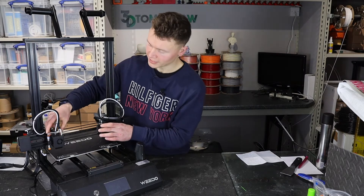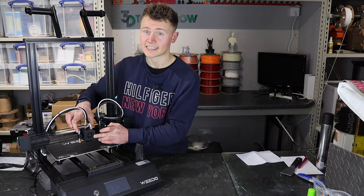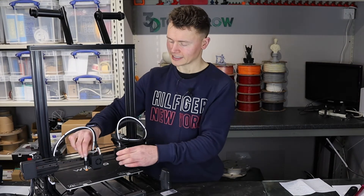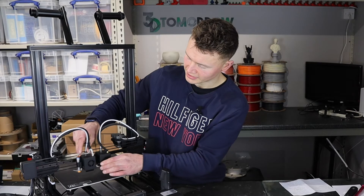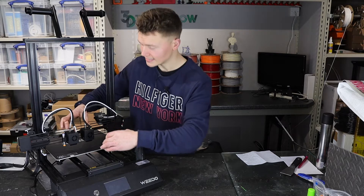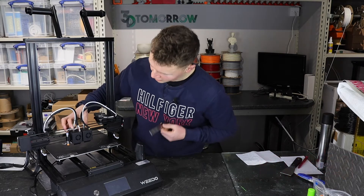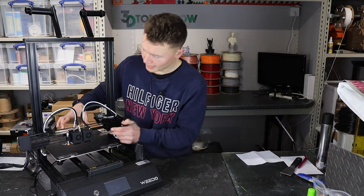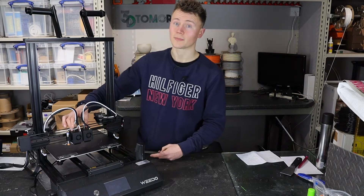That's all quite nice. On this side it's a little bit less X-efficient because we are incorporating the Z sensor as a magnetic probe sensor, which adds another couple of centimeters to the X axis. But efficiency is important in an IDEX printer because it maximizes the space where you can get both printers going before they hit in the middle. The less space these can take up in the X axis, the less of a loss of part size you've got in between them. When they're put together, that's the amount of bed you lose when you're printing in IDEX mode — about five centimeters. Not too bad; I've seen much worse.